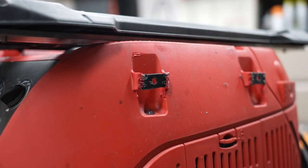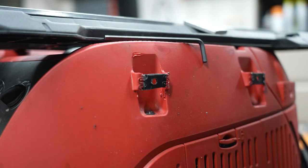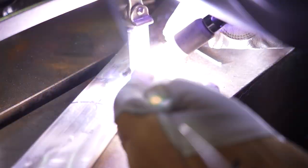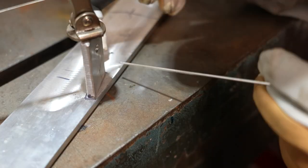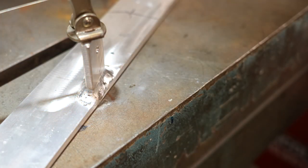So basically what I'm going to do here is make a really secure and accurate tracing of where these little plates need to go on the bottom of the aluminum, and then try to weld this whole assembly outside the plastic housing — probably should have started there. If it was steel I bet I could have gotten away with it, but with aluminum taking so much heat, especially being so thick, it just wasn't going to happen. I'm not the greatest aluminum TIG welder, but I'm able to get by — and this material was definitely harder to weld because the weld had to be so hot.